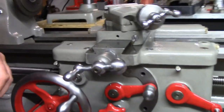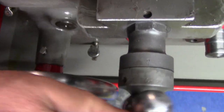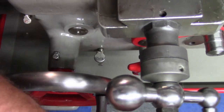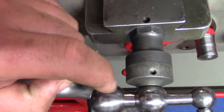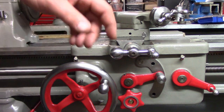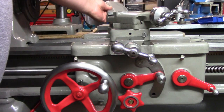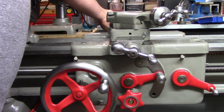Let me tilt you in a little bit. There's no real backlash adjustment on these lathes, but what you can kind of do - you can see when I wind it different directions the screw kind of unscrews itself a little bit. You can actually get a washer and put it in here to take out some of the backlash that way, just take up that slack. That gives you a little bit of a backlash reduction - not really a true backlash adjustment, but it can help you out a lot. Everything in here is nice and moves. The only other thing I need to put on is just the extension cover, which bolts right to the end of the cross-slide and just covers the screw - I just have to get the screws for that, as the ones that came out were damaged.